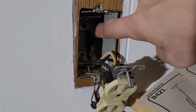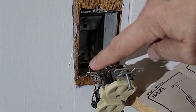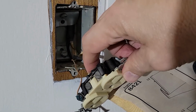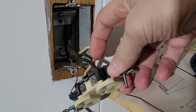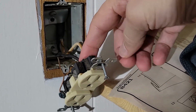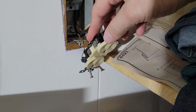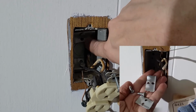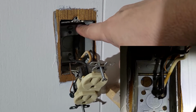Since this box consists of just a single wire lead coming in here with a neutral, a black, and a ground, all I'm going to do is just disconnect that from this outlet. If there's a screw for the ground, the neutral and load are actually push-in, so I'm just going to cut those off. Once I get this out of here, I'm just going to move my wires out of the way and then take that screw out, loosen this top plate, bottom plate. Gives me access to the nail.